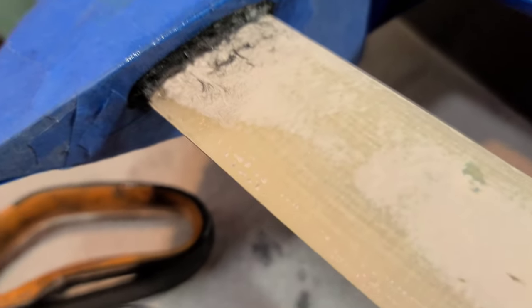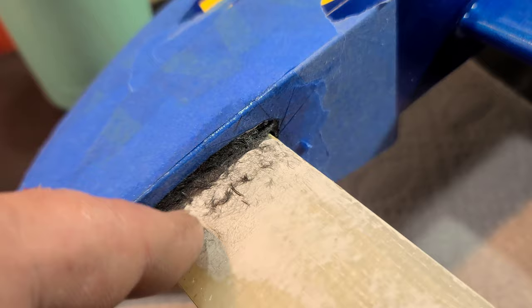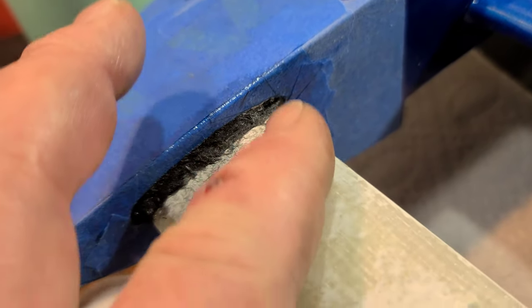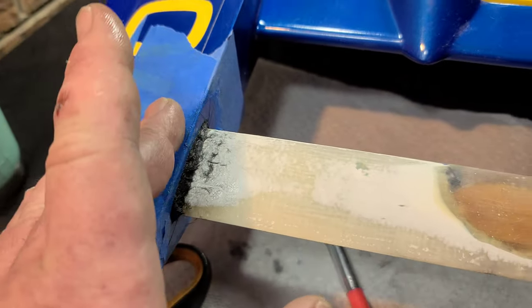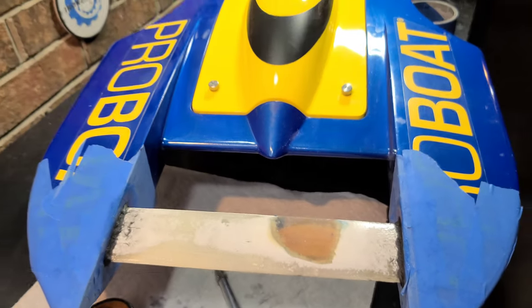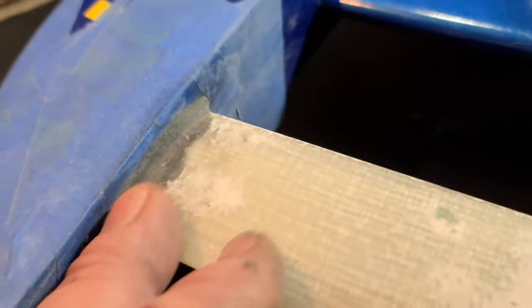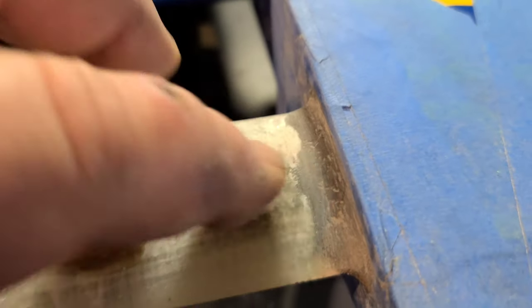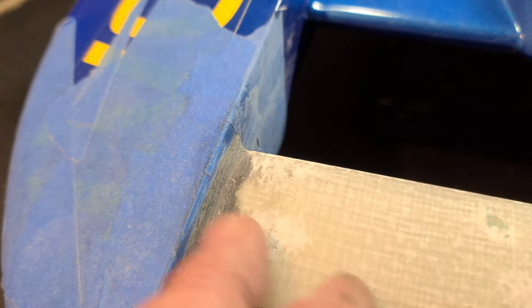Flipped it over — same thing on the top side. Actually looks pretty good. I know I'm gonna sand it and may feather a little bit more into the hull and fill it in again, just to get a nice filled fillet-looking area for a smooth transition. I've got two applications of epoxy — sanded the first one, reapplied, now I've got it sanded and profiled top side and bottom side. That's going to blend in the carbon fiber we lay down. The ends may feather once we lay it out, and it's acting as a buffer for the transition and supporting the winglet.